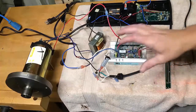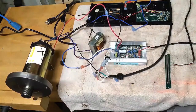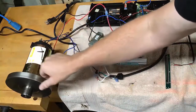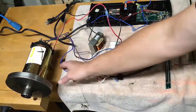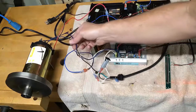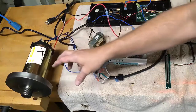Let me just run through this. This motor is a GS Electric 2 horsepower, 130 volt DC motor, and this thing will spin at 5900 RPM at 17 amps. It's kind of small. It's got this kind of cast iron flywheel on it. It's got a thermal switch in it — that's where I've got four wires coming off, red and black for power to the motor, and then two blue wires that are a thermal switch that help protect the motor and keep it from overheating.